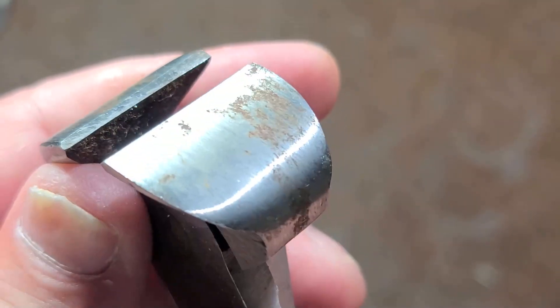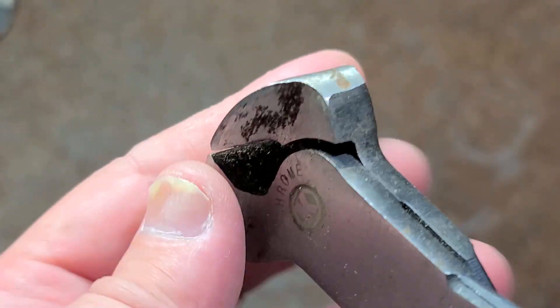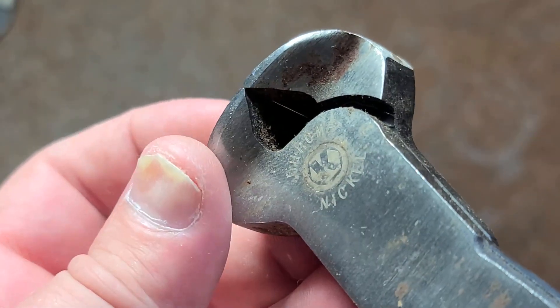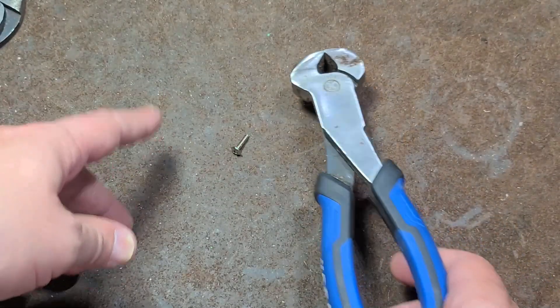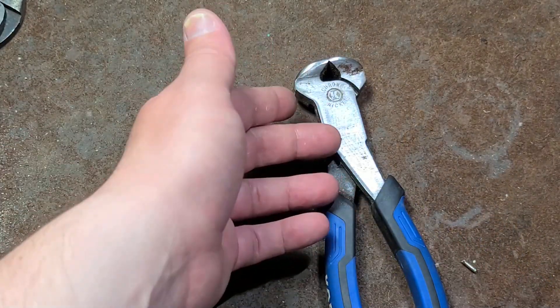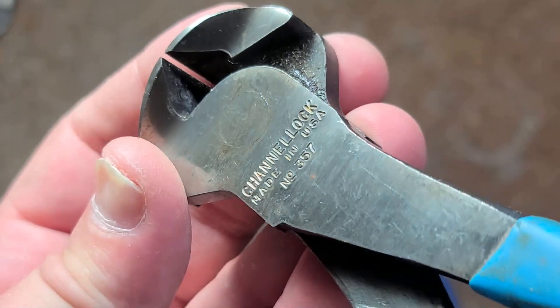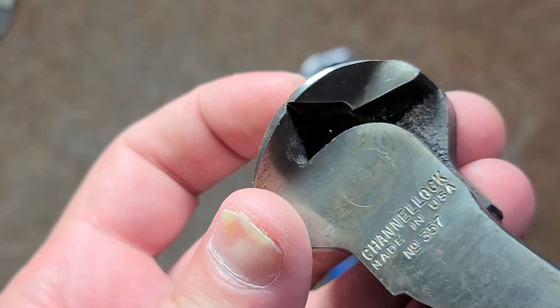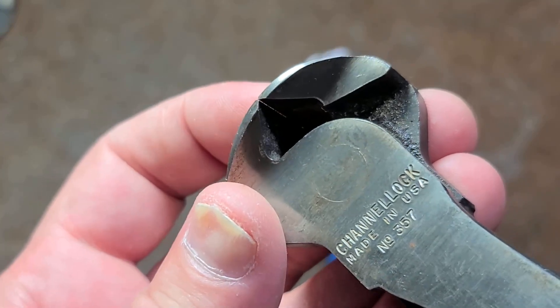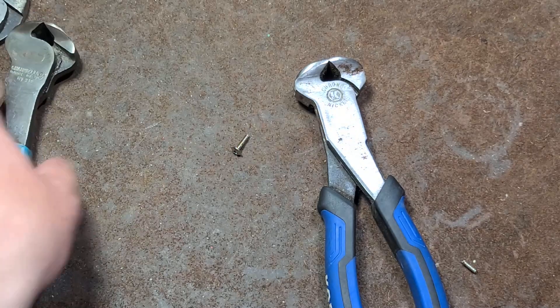So the grind — even though these jaws don't actually have any nicks in them — the problem is that they're just not ground particularly well. And since that's already in the center, when they do get a little bit rounded through use, they're going to leave ever-increasing burrs. These types of cutters really need to be good. If you just barely close these channel locks here, you can see that there's no light — a little dribble of light where there is a little ding — but the jaws on these are really supposed to be very tight. So that's another disappointment.